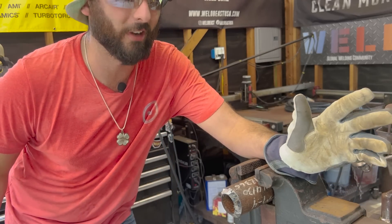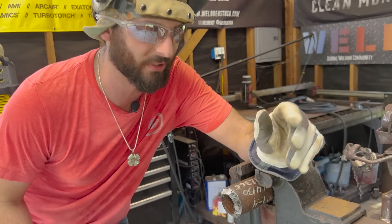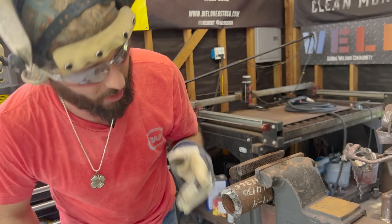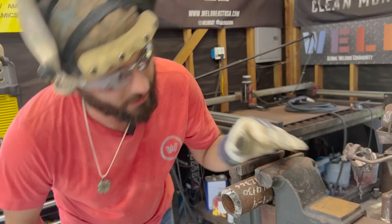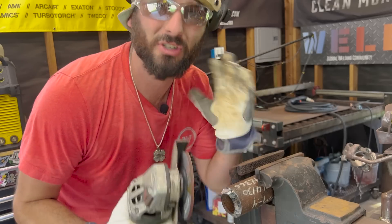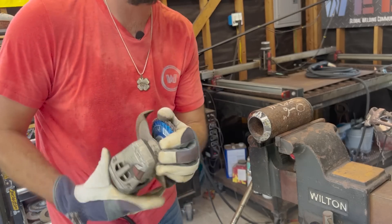We've been grinding for about five or six minutes and we've got the bevel on there — you could probably slap it together and weld it. But let's take some pride in our work. I really like staying on one side of the pipe; I could see my back line really well and the front edge. I went a little excessive getting to that land — I've kind of thinned it up. You can't grind all the way to a knife edge and then add a land back, because now you're removing metal again and the piece might be out of tolerance. Compensate for that land, or don't grind it off in the first place.